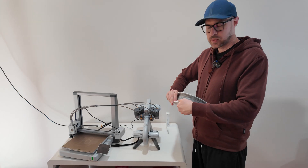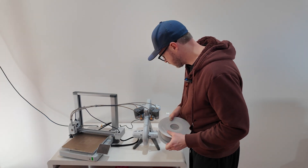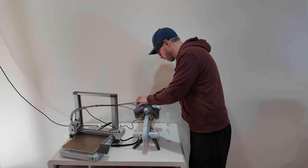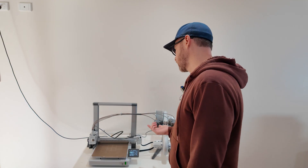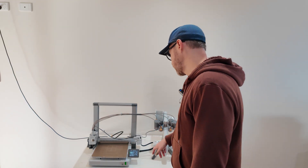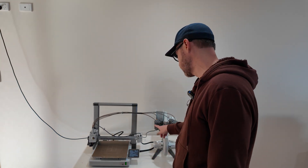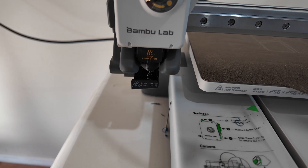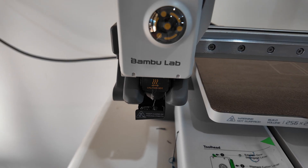So let's add some filament. We have gray for the gray, which goes on the one slot, so that goes here. It's supposed to load the filament itself but I had the machine off, so I've turned it on. Then if we go to PLA, the one slot, and then go load — it's lit up, now it's loading, and you've got the old filament coming out and it's turning gray. And that's the first one loaded.